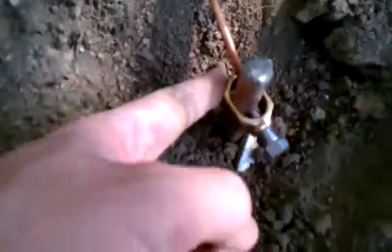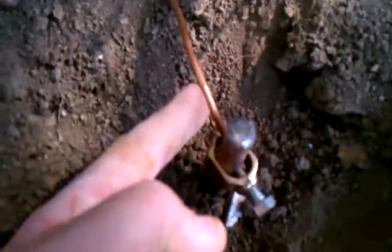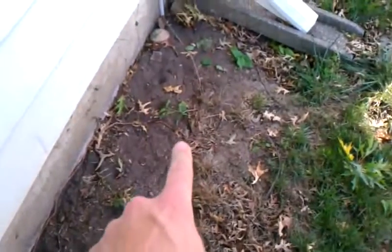This is installing a copper ground rod in your home — this wasn't here previously. You get the copper ground rod at the home center; I got mine at Home Depot, 5/8 inch, for under $12. You also get a 5/8 ground rod clamp, which is pretty much nearby, and then number six copper wire, because I have another ground rod over here.